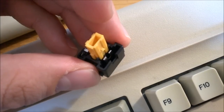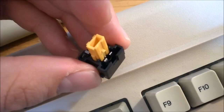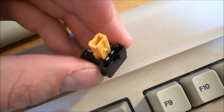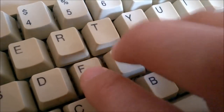The secondary effect of this system is that there is no hysteresis, because the actuation happens at a point where the clicker has not been engaged at all. And the tertiary effect is that the switches are really, really tactile, so overall they feel and sound like a much more extreme version of Alps switches.